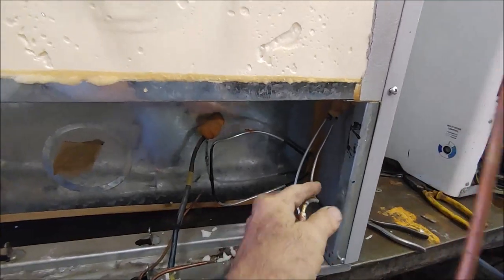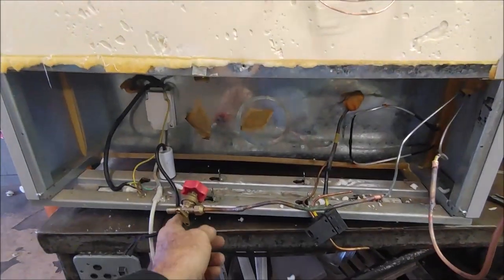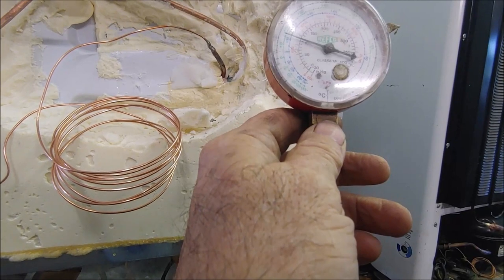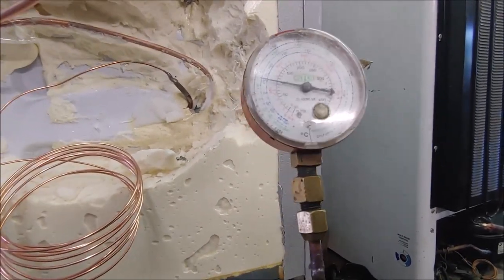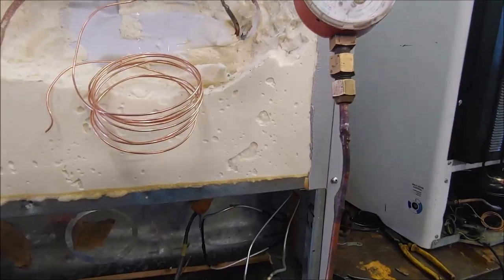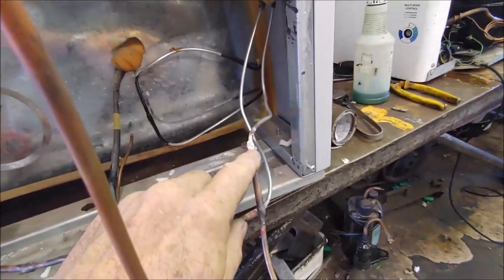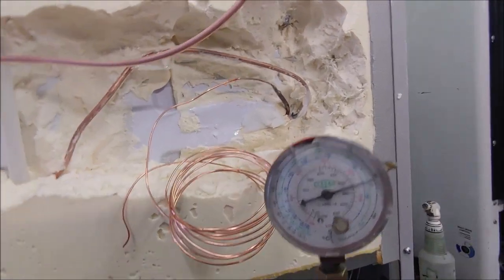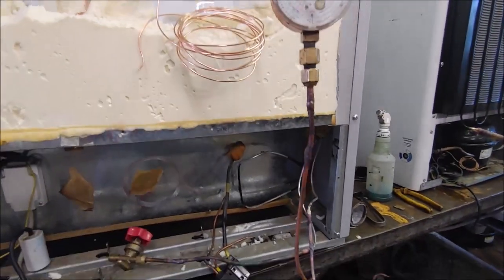On the high side I've connected a pipe onto a gauge and put a service valve on there, and with an old compressor I pumped some pressure in. It's showing between 50 and 150 — about 100 PSI — so I'll leave it for an hour. If it drops, I look for a second leak; if it doesn't drop, the high side is okay. Within a short period the pressure started dropping, so I checked my welds and found a small leak. This time I've pumped it up to between 300 and 350 PSI and I'm going to leave it for an hour or so just to make sure there's no leak in the internal condensers.